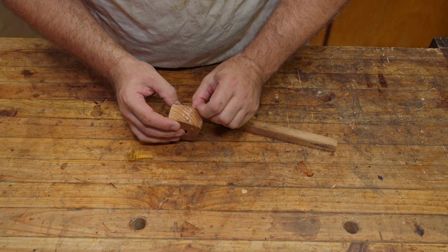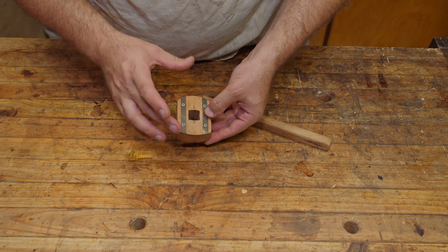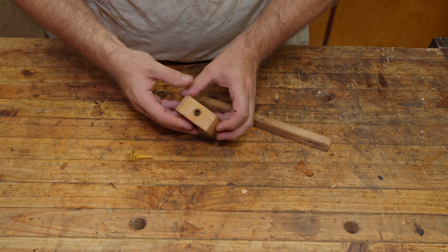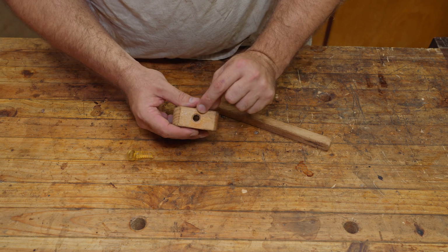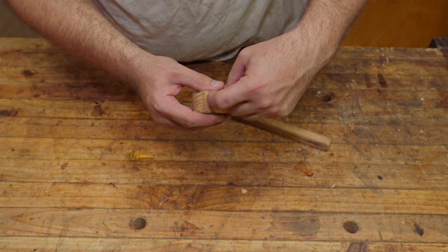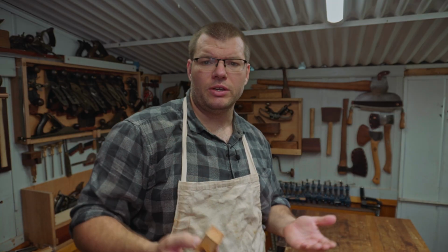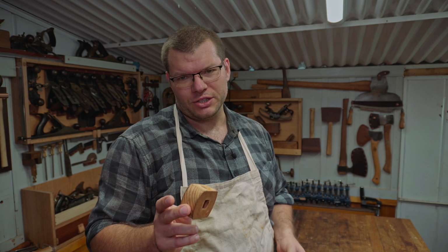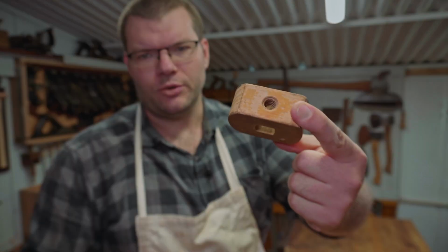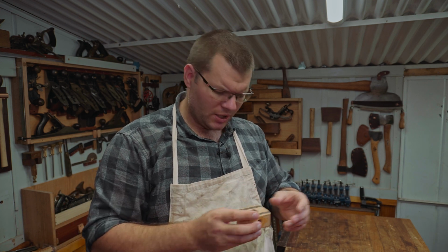Now on this, they're a little loose, so we'll have to look at doing those screws up a little bit before we do just a tiny bit of work to restore this. Now, we see this scattered part just here. That is amber shellac that was on this originally. When I looked this up in the booklet online, it said that it had a polished headstock, so that accounts for the shellac being on here, and they would have polished that up so it was nice and shiny.